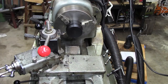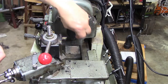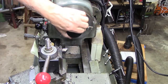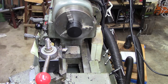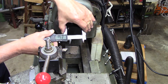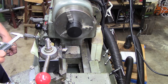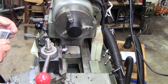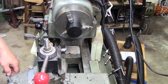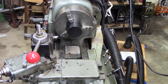That's smooth — smooth as a baby's bottom. Let's see if it's anywhere near a standard size. That's 2.192 — I'm going to call that really good. Now to drill a little hole, then we'll get a boring bar and bore it out to the right internal size, and then we'll thread it.